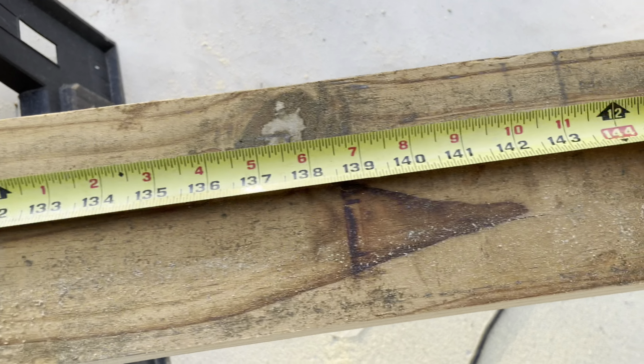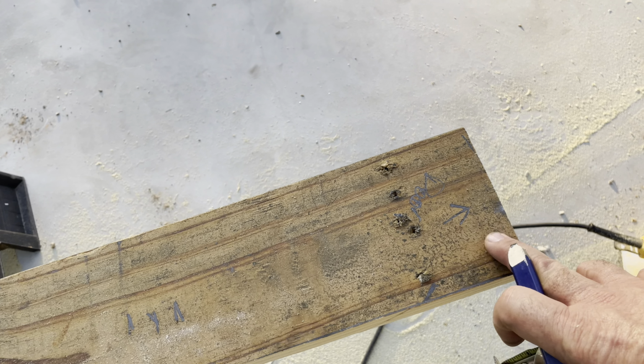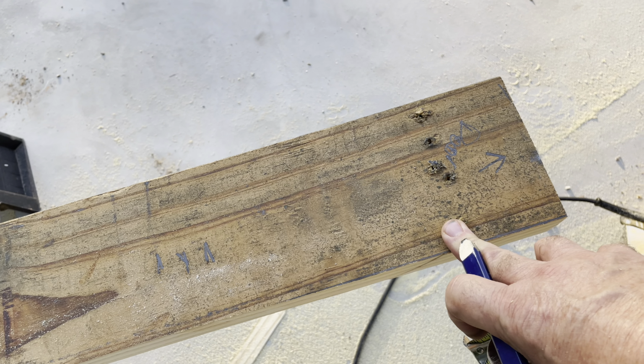I said it ends with 12 foot 11. Down here, there's going to be triple studs to help hold the... I'm going to do three 2x4 studs, or cripples rather, and then one stud on the end. So you'll have four on each end, three holding up that door. So I'll go ahead and draw the lines on here now, and I'll get this ready to figure out where the door is going to be, because there's going to be a walkthrough door on the front.